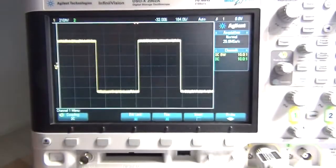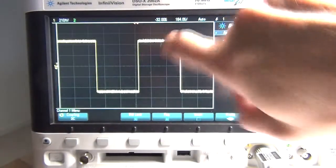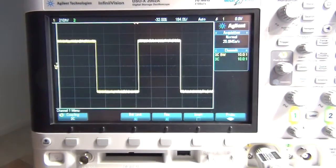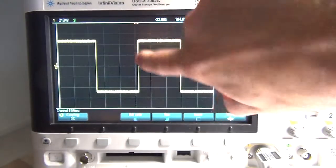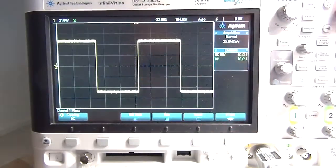You get a whole box full of a range of resistor values, and it's the same for capacitors. So I'm going to be using that to pull out a bigger resistor. I'm going to fiddle around until I find one that gives us a charge curve. I'm going to connect it in conjunction with my decade resistor box so I can at least play with it, but I want to get to the point where I've got that nice charge up curve.